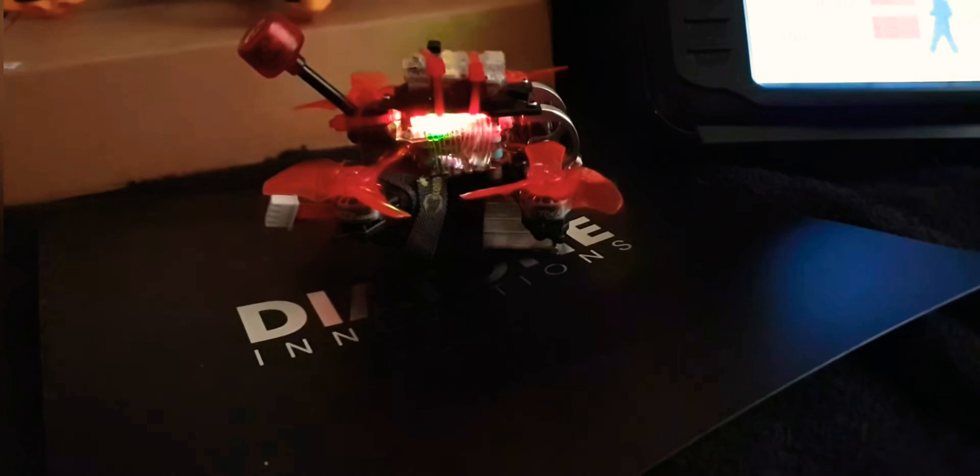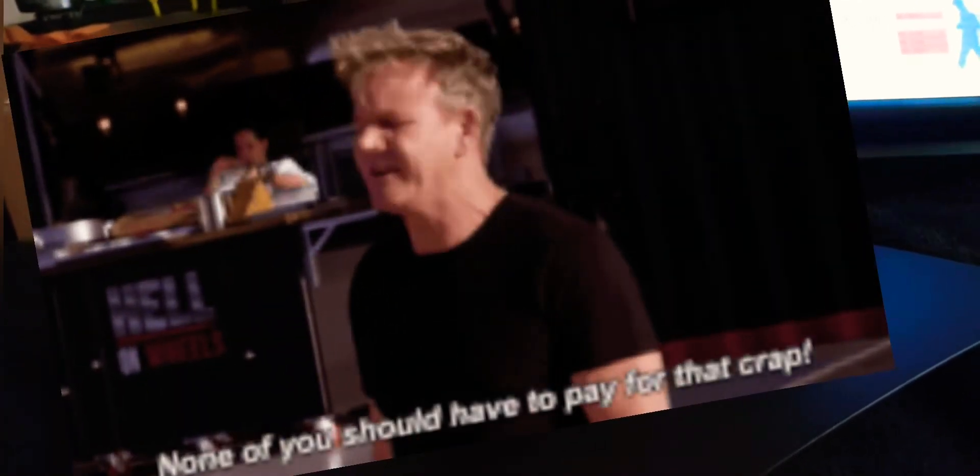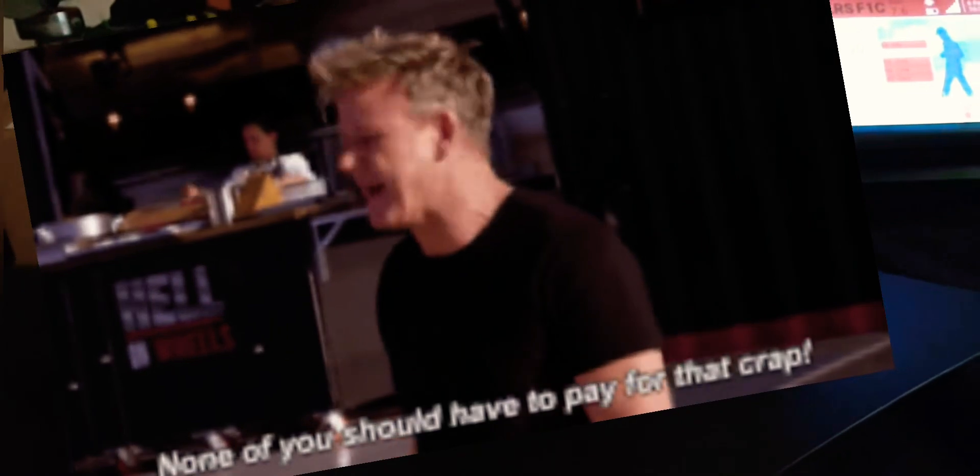Using FrSky — sorry to slate you guys, but this came with an FrSky receiver. And if you watched my previous video, the RSSI pretty much goes down to about 55-60 over the length of a whole rugby pitch. It's a tiny quad, but I'm used to ExpressLRS and that didn't cut it for me. Look at that little ExpressLRS antenna.